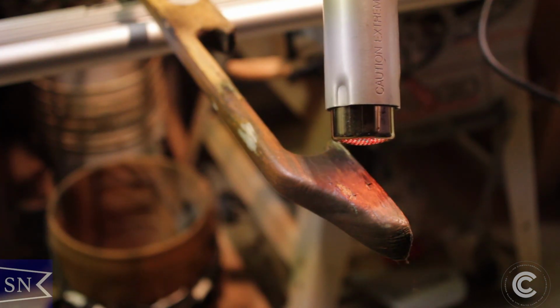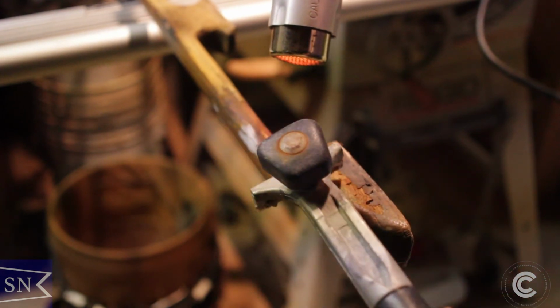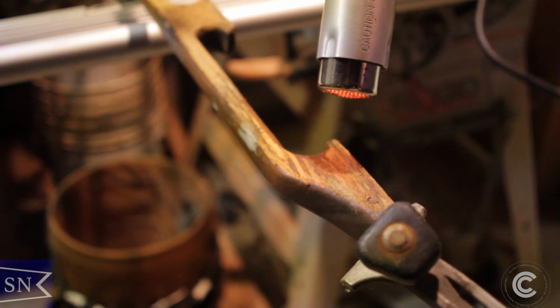The handrails are the hardest to strip because there's absolutely no flat surface on them except for the underside, so this is a place where a heat gun can come in pretty handy. Just apply it until it begins to bubble, a light scrape takes it right off. I will need to do a little bit of sanding on these though to smooth them out.